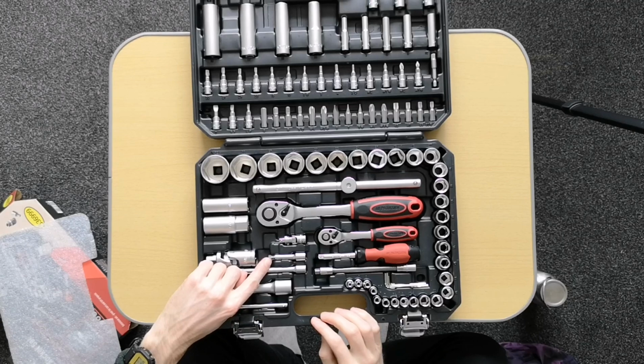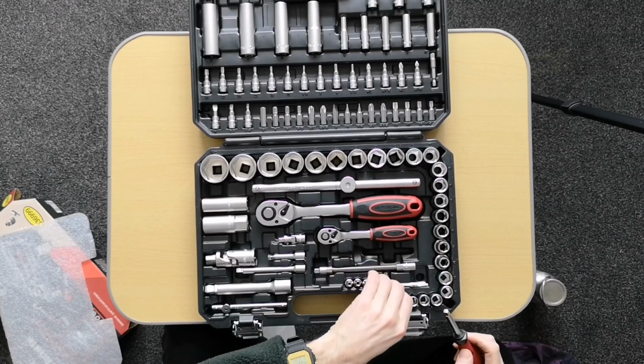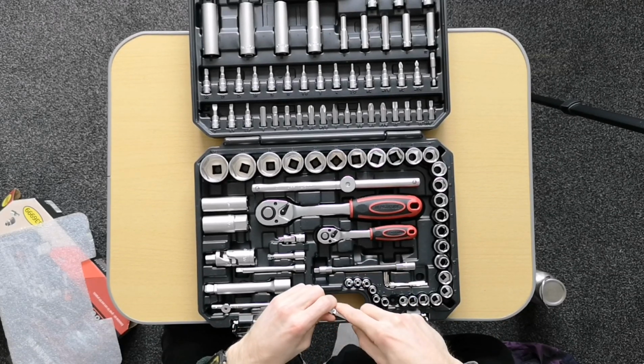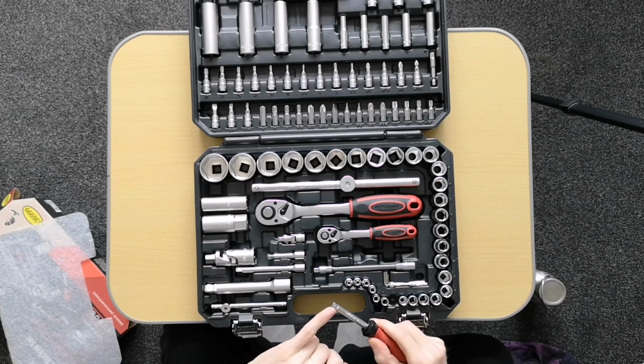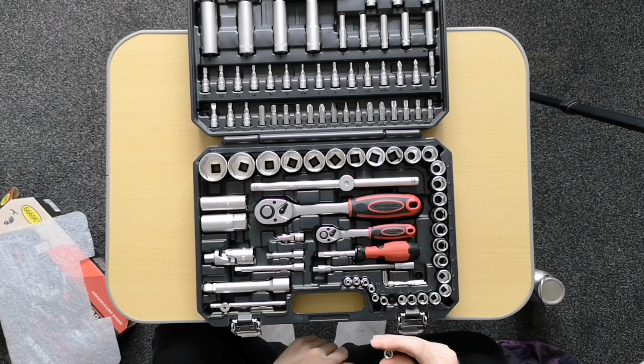And you can also drip oil into these ball bearings. If you take a socket, slide it on so the ball bearing gets depressed but it's still exposed, then you can drip a little drop of oil and that just gets oil down in there into the spring behind the ball bearing, and then if moisture gets in there it's less likely to rust or cause any problems.